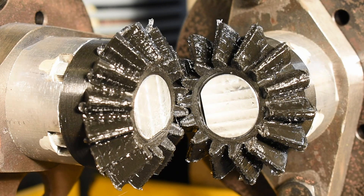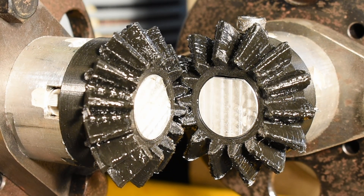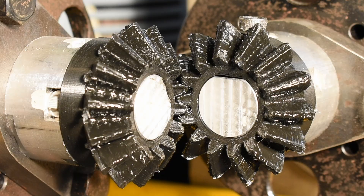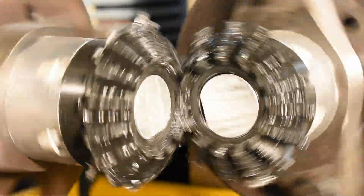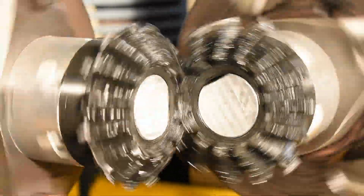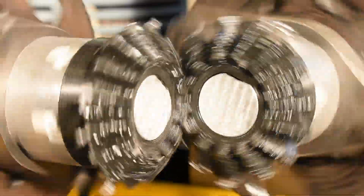The final test is the wear test. As I said before, this test is the most complicated. First it orients the gears so the measurements are consistent. Then to find the backlash between them, it applies the testing torque in one direction, measures the alignment of the gears, then flips the torque direction and tests again. The backlash is the difference between those two values. Once it finds the backlash, it sets the gears to the running speed and applies the running torque. It continues running until it's time for another backlash measurement, and the cycle repeats until either the gears fail or they last the length of the test. All useful data is saved in a file for later use. I guess I'll end with running some more tests. Thanks for watching!